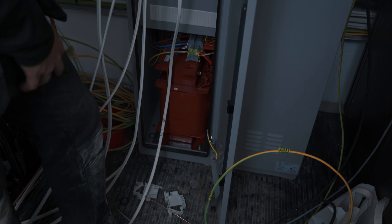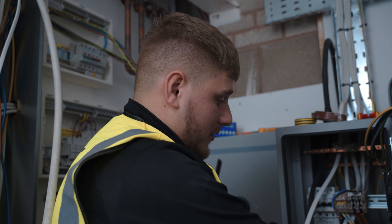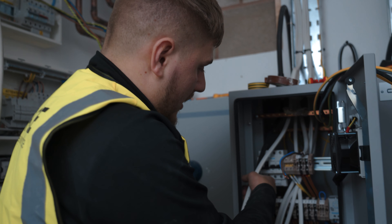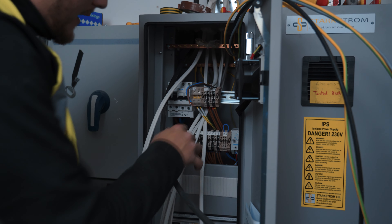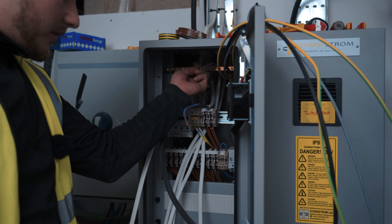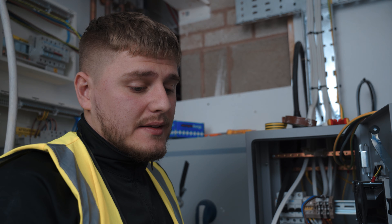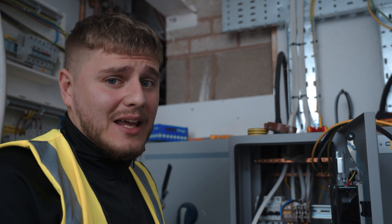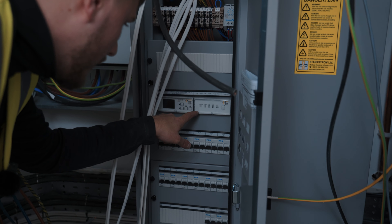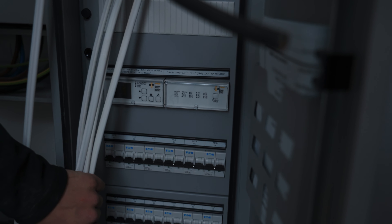Yeah, you just want to try and rectify that before the second fault. We've got a transformer down there — that's that big old thing, weighs an absolute ton. And yeah, it's actually super easy from an installation perspective because you're just on these DIN rails here. You've got your incoming double pole switch here, you've got your double pole out which goes to the alarms. And then yeah, we've just got all our circuits going in here, our earths go in there. These two bonds go on here too, which pick up the EBBs — basically the earth bonding bars, which are earth bars with transparent lids. They go into the theatres, into the rooms that these serve. They're just accessible, visible — I'll probably be able to show you one of them as well. I've also got this fault relay here as well, so it will literally tell you the circuits that the fault's appeared on, and then you've obviously got them remotely too.